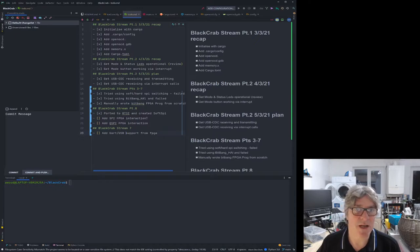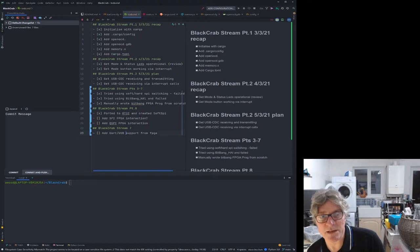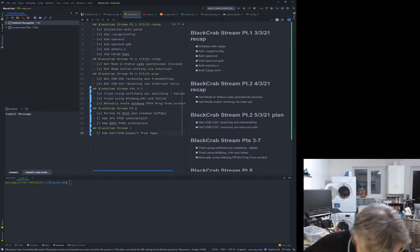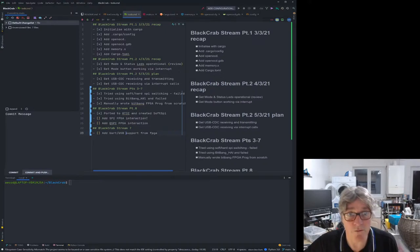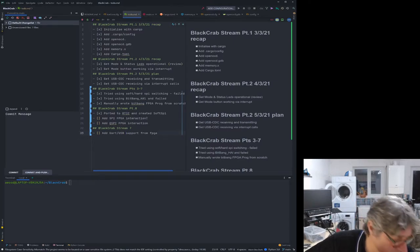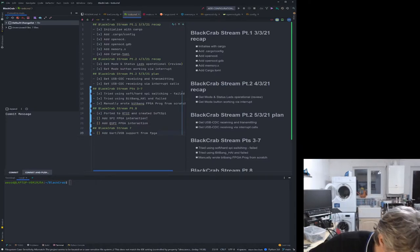Now QSPI itself is backward compatible with SPI, so you can put it into an SPI mode or DSPI or quad SPI. In our case, eventually we will need to go to quad SPI because that's what we're going to support in other versions of this. So for the robot board, for example, I expect there to be a quad SPI link between the STM32 and the FPGA. On the amalgam, then we're using the FMC bus, which is a different animal.